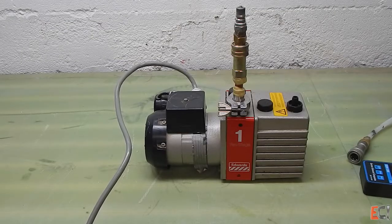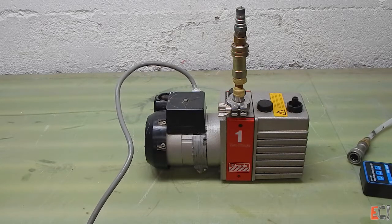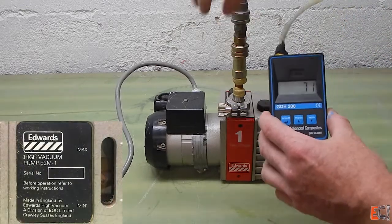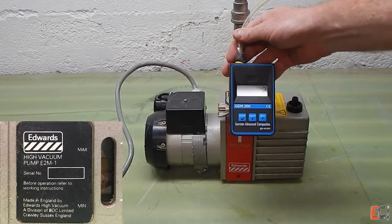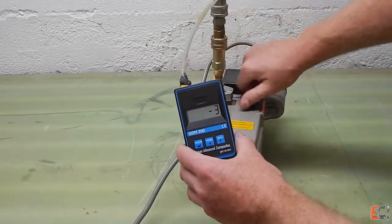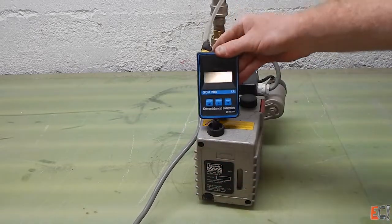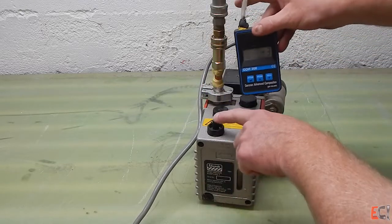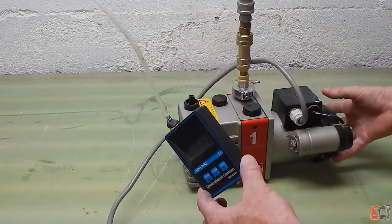This tiny little one is an Edwards high-vacuum pump. It's a rotary vane pump, but the vanes run in oil, so it pulls much higher vacuum than the dry pumps. You can see my gauge needs calibration — we're at negative 2 millibar. It also has a gas ballast, which allows you to bleed in a little bit of air as the pump runs, to allow moisture to pass out of the oil. It's a tiny pump but a nice little unit for doing pre-preg, or something where there's not a lot of moisture or volume.